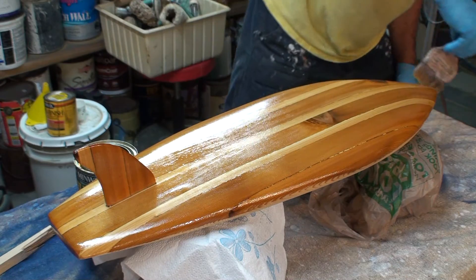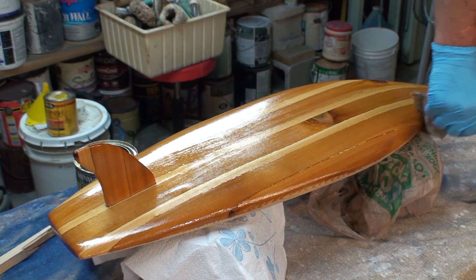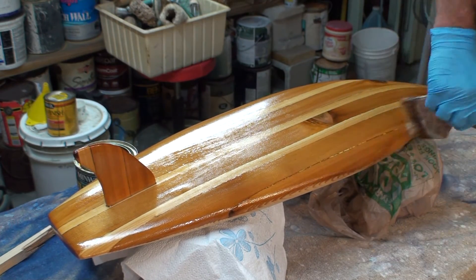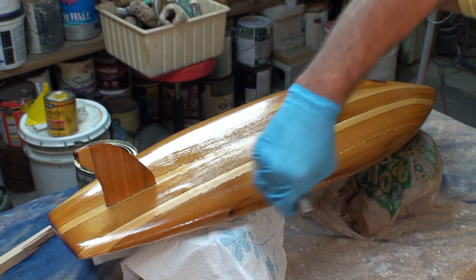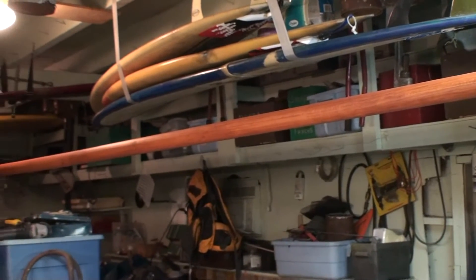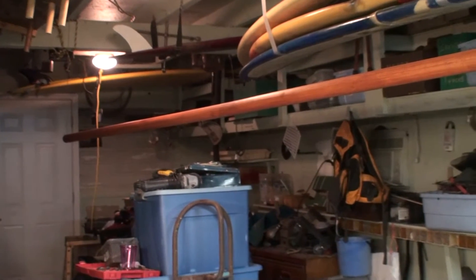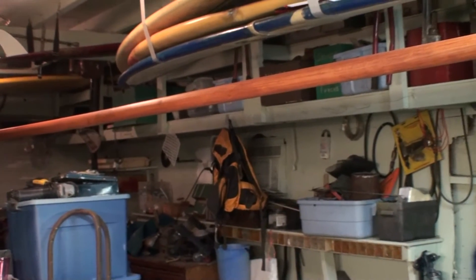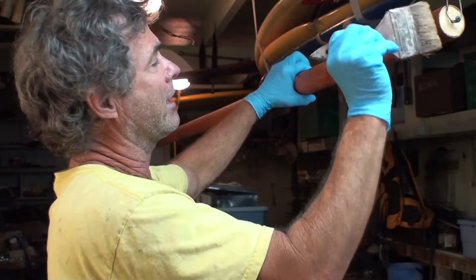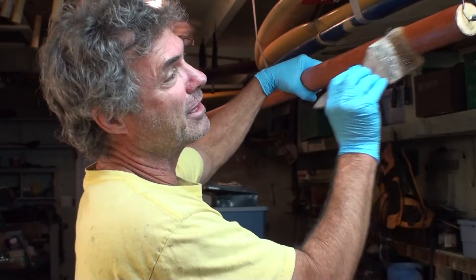This coat's not going to look all that good like I said before, but after I sand it and put another coat on it will look a lot better. This is the flagpole — a long wooden pole that I've already stained and now I'm putting a coat of spar varnish on it. I ran screws in the ends so I can rotate it as I'm painting, which makes it a lot easier.